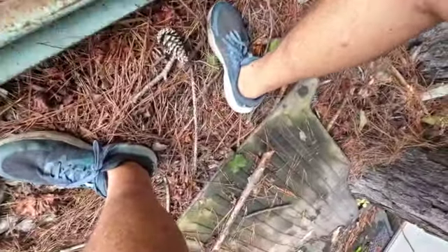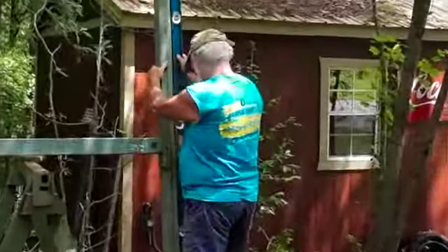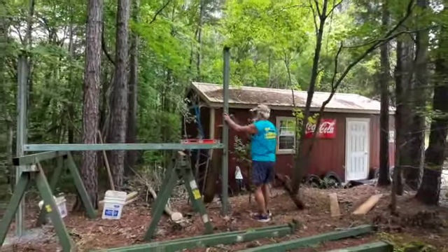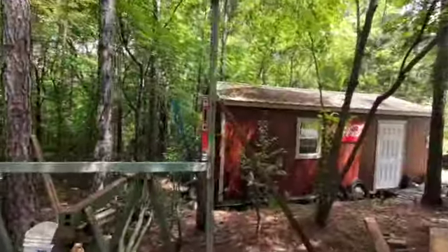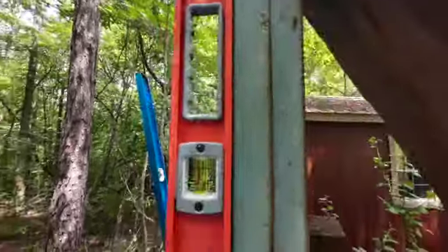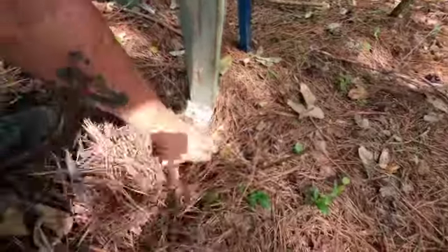This is going to be my next post — it stands up over there. What I've done is I've got this pretty close to where I want that post to be. I don't have a hole under there yet, but I'm going to make one. From this angle it's not perfectly level, but it's close enough for me to dig a hole. From this angle too — same thing, pretty darn close. So I'm going to take this off and I need a mark down here where I want this hole to be.